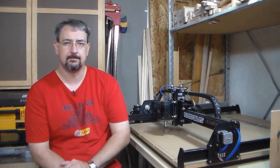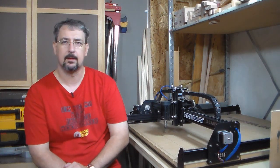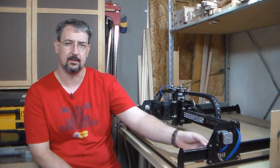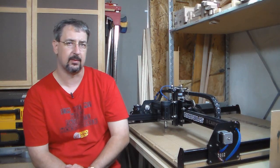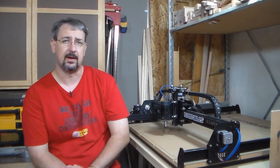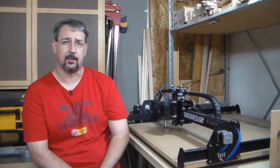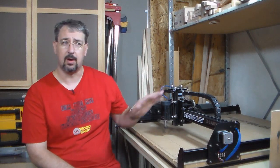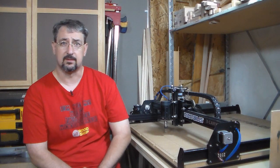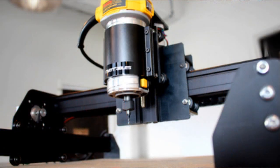So what's my opinion on this machine? I think it's not bad — definitely some room for improvement. I don't really like how the V wheels work with the eccentric nut. It seems like after almost every cut I have to go back and adjust them to either tighten or loosen them. I would highly recommend upgrading the spindle to get either a quieter or a stronger one. I'm thinking about getting the Bosch Colt or the DeWalt 611 — Inventables actually just sent me an email saying they have the mount for the DeWalt 611, so that may be the option I go with.